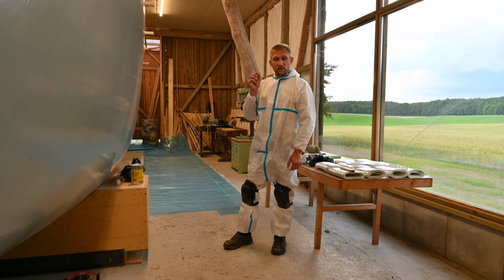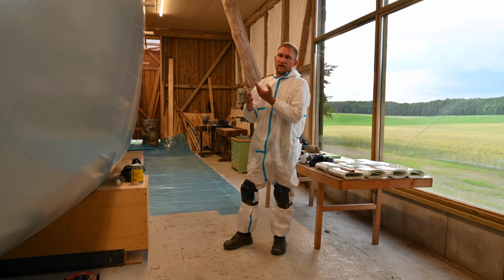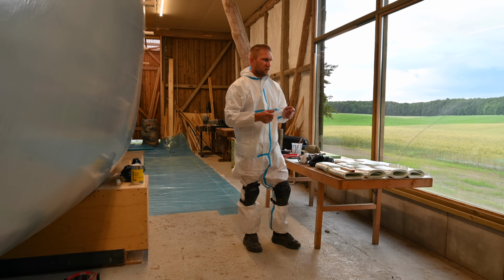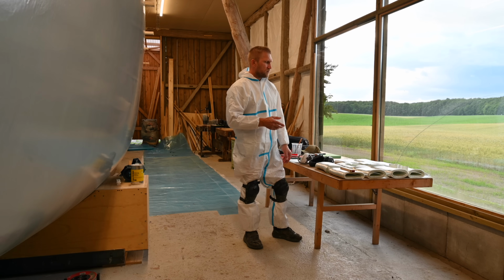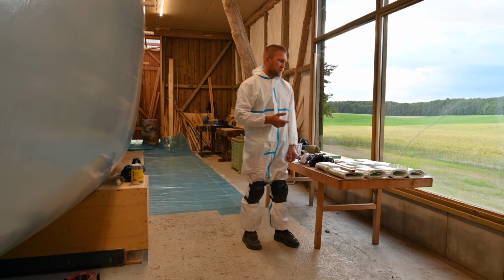And I will keep using those stainless steel staples, because that was a really big help once I started using those to keep the pieces from sagging down, and it made it possible to add all the layer in one go. But even so, I have to say that this cloth is so much better, you can really handle it without destroying the weave. The actual saturation of the weave wasn't really a big thing, being a heavy cloth like it is. Just took a bit longer, but that's okay.